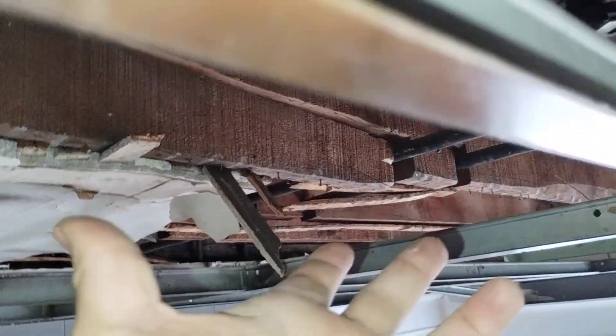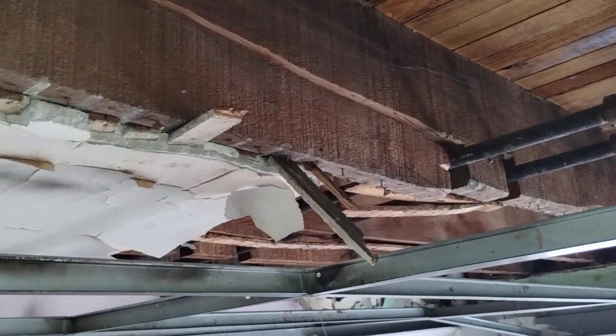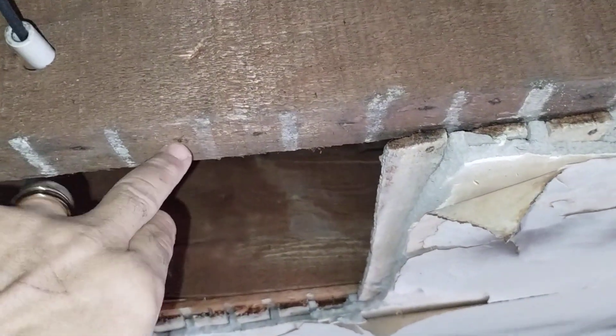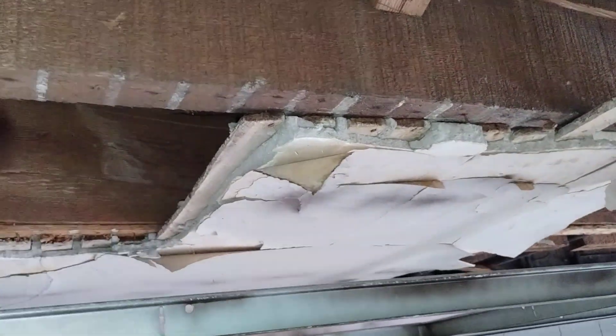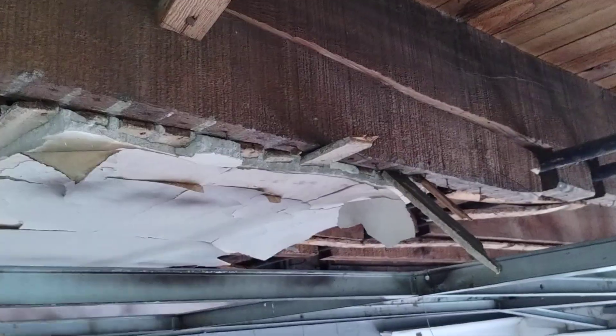The ceiling is going to be removed. It's going to get a strap underneath - a metal strap on the bottom, the tension side of it, securing it to the bottom of the joist, considering any pull-out. I do have a value for this, about 1,200 pounds is my estimate. We're just going to metal strap it and then sister it. Belt and suspenders - both protection.